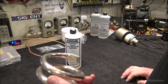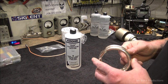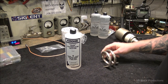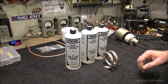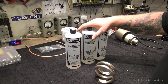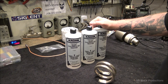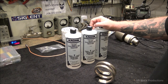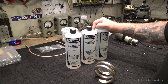We actually solder the ends shut because you can plate the solder as well. The tricks of bending this stuff smooth usually involve salt and sand, which I'll also cover. But I bought, just for this particular build, 3 new bottles of solution, and they will all be completely depleted. And you can find this stuff on eBay pretty easy. This Kronhan silver plating solution. But inside these bottles is poison and death. And during the electroplating process, it produces gas, poison and death. Death all the way around.